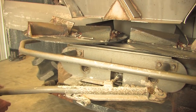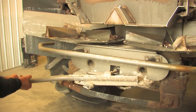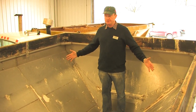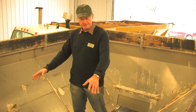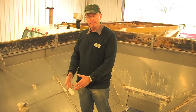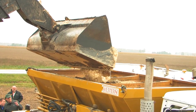In this case, for gypsum we move it farther back; for fertilizers we want to move it forward. This is a unit that's set up perfectly for gypsum — it's stainless steel with slick steep sides and a wide belt, and it does not have the shield assembly over the belt, so there is nothing in the interior that's going to cause any bridging with gypsum.